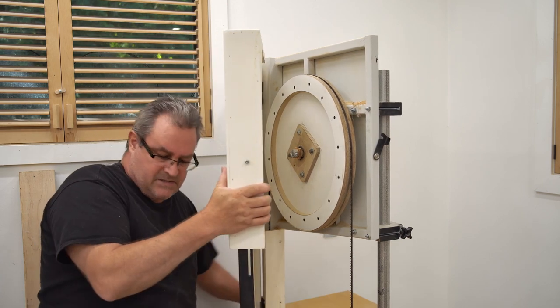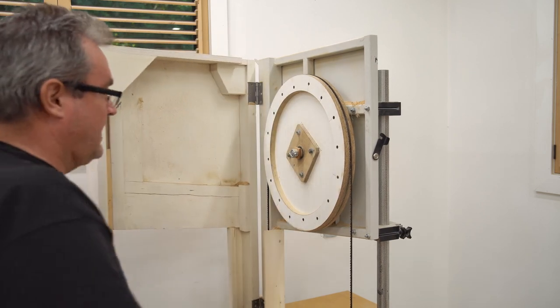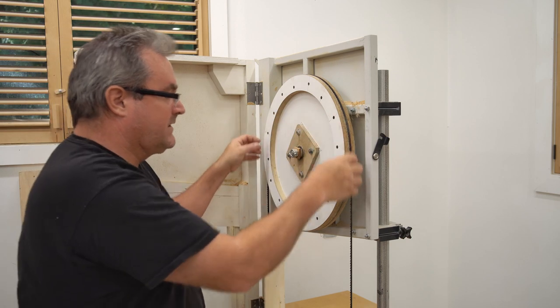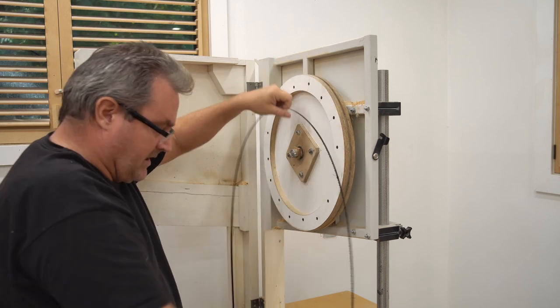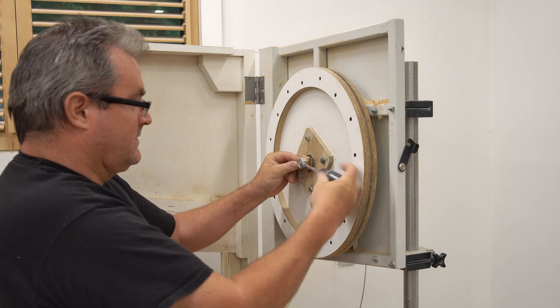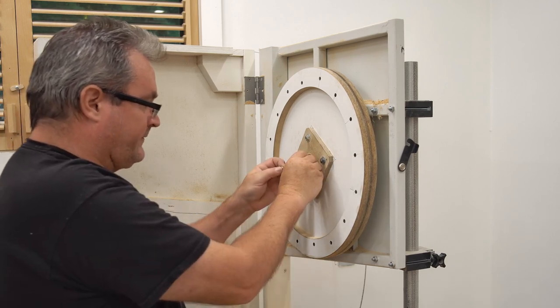Okay, I'm going to release the tension on the blade. And the way that works in this bandsaw is that the bottom lifts up and down. The top wheel doesn't move. And I've got a crank in the back there. To do that, I'll take this off. Start to take this wheel off. It starts with this short bolt that I have going through here that locks this nut.